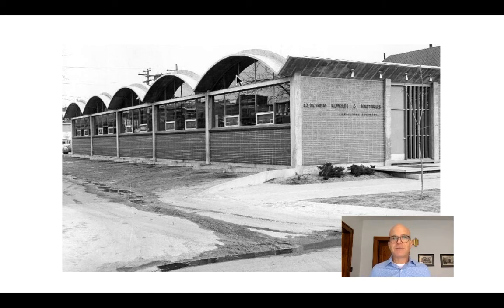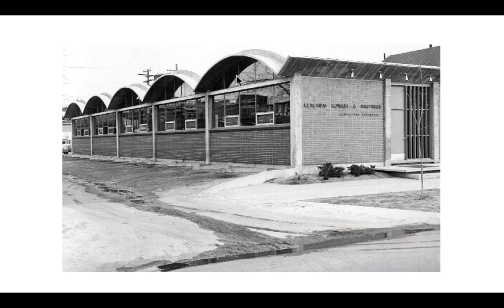Like any surface structure or folded plate structure, we're looking at both the overall macro structural performance — that is the long vault — and this range of secondary structures that force the vault to maintain its shape, keep its curvature, and keep it from flattening out.